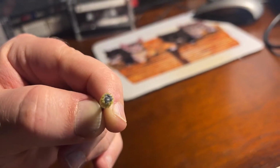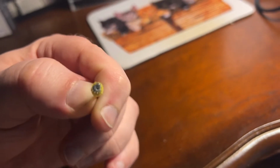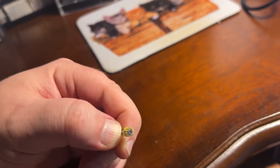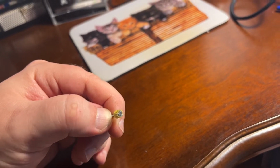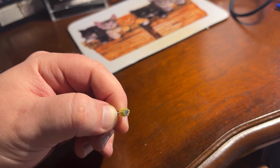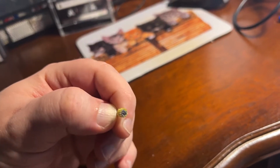And I can't show it. I can't even see it myself right now. But the two teeth kind of get wider. Okay, I think I have it right at the very top. You kind of see it. So what's going on right now, the tape deck does work. But just like the GE, it was going ka-tunk, ka-tunk, ka-tunk when it was running. So one, that's probably not good for the other gears it's driving, and also it's inducing a lot of flutter into the audio. So I am going to show tape deck operation, but that's it. Until I can get another gear for it, I'm not going to use it.